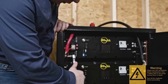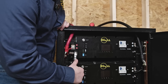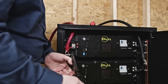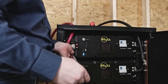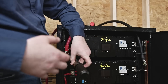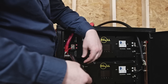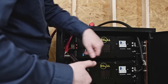Here is a four-aught cable with a UL crimp on the top, and we are connecting it to an M8 bolt. I have my torque wrench set for 18 foot-pounds as we discussed, and I'm going to show you where the click occurs right here. You can see how it clicks right there. If I keep turning, I will strip out the screw, probably ruin the rivet, or do all kinds of damage if I continue doing the wrong thing. But this is what a torque wrench is for — exactly the torque we wanted set for the bolt.